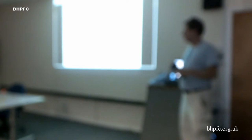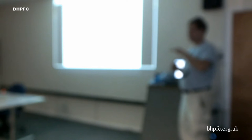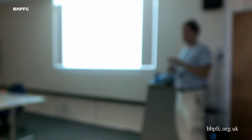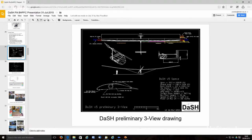We could do that. Or there's very low temperature adhesive backed films that we could put over. I looked at some of that with UCI to try to solve some of their problems. But what we did is we took an adhesive backed Mylar that's 2/1000ths of an inch thick. So that added several kilograms to the airplane to cover the Depron, thinking that we're not really going to get laminar flow with the slightly bumpy surface of Depron. Maybe that was a mistake. You'll see some FlowVis stuff that we did based on that. Anyway, this is the airplane as it is designed.